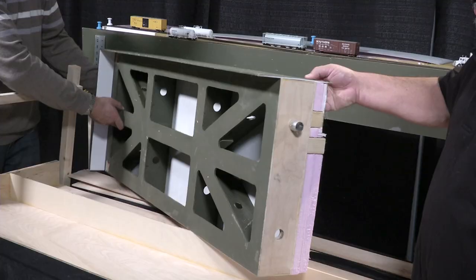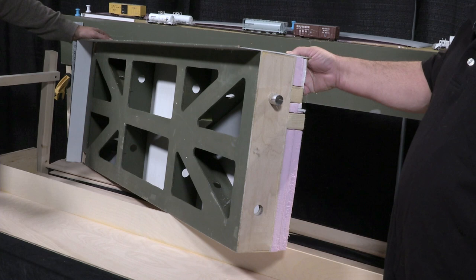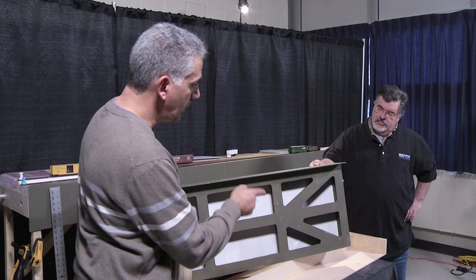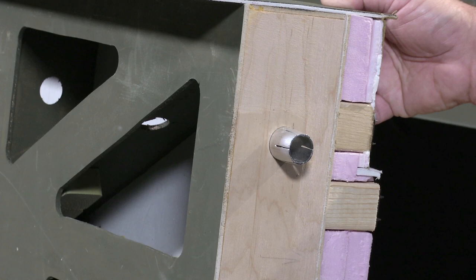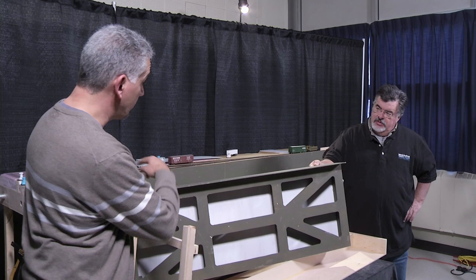Let's take a look at the end of the module. You'll see there are two holes — each one is a one-inch diameter hole. I went to Home Depot and got some aluminum tubing, cut it to length, put four slices in the end and bent it in as a lead end. Those then align the modules very nicely. The idea is to clamp across those — I use C-clamps or squeeze clamps holding the modules together at the joints. The level underneath just helps me not have a leg in the middle there for this particular display.